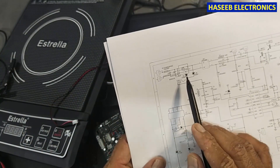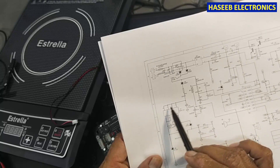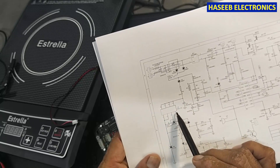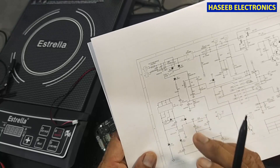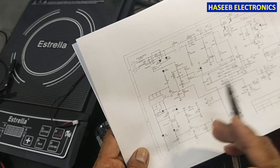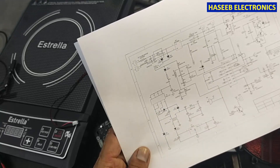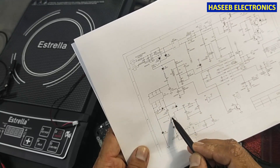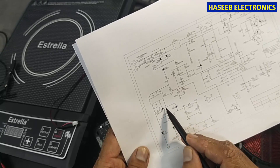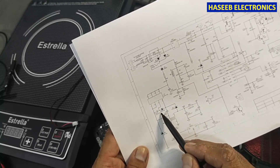From the same line voltage we have a full wave rectifier - two diodes - then these voltages reach this capacitor, which is a 450 volt 47 microfarad capacitor, and it comes to this offline switcher: VIPER 12A, VIPER 22A, LNK, TNY, TOP - any switch. Because it is not using any optocoupler for regulation, it is just a switcher. It works as a buck regulator step-down converter. As feedback, when this winding generates a magnetic field, it will rectify the voltage and these voltages will reach this capacitor at the feedback pin - that is the enable pin, pin number four in VIPER 12A.